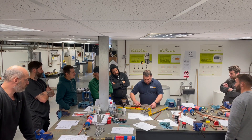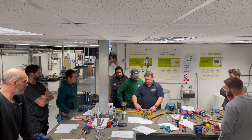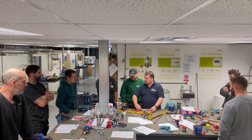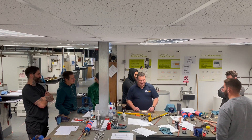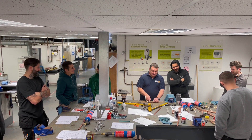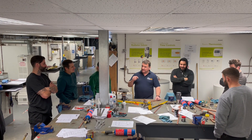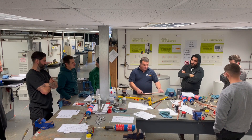Slide that up so the edge is right on the scratch line and then it extends past — it just makes it easier to measure. What's that say? 125. And what should it be? 125. Whenever we do measurements, it's centre of pipe — centre of pipes. That's my 90 degree done.